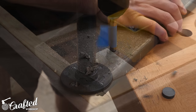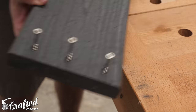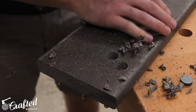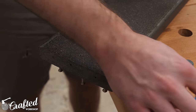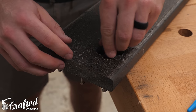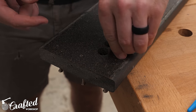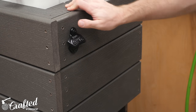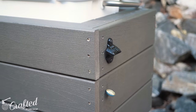The final touch on the patio cooler was to add a bottle opener to the side of the piece. I decided to make things a little fancier and add a few rare earth magnets to the inside of one of the boards, so that the bottle caps catch magnetically instead of falling on the ground. To do this, I removed one of the side boards and drilled a few holes on the inside face of the board using a Forstner bit that matched the size of my magnets. I then used some CA glue to install the magnets into the holes, making sure to orient them correctly so they would catch the caps. After reinstalling the board, I tested it out with a well-deserved beer, and it worked perfectly. And with that, the patio cooler was done.